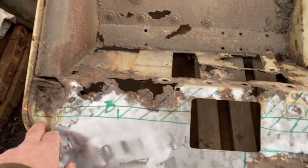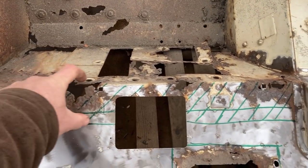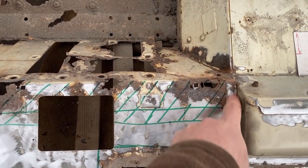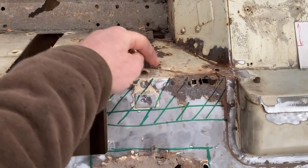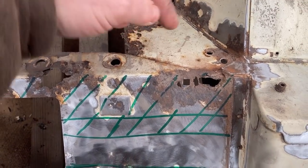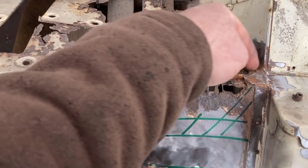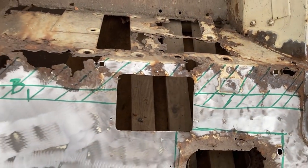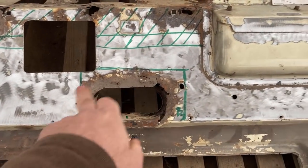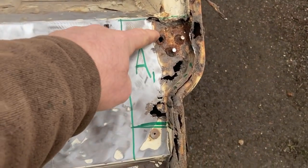So my first challenge is cut a patch out that I can put a fold down and basically just replace that all the way across. So it'll be butt welded along here. Lap welded into that. It seems to show a diagonal joint there. I'm not entirely sure how that's going to look on the footwells, so I just might take it straight across on the basis of it's easy enough to chop it out rather than add it on. So that'll be first patch. I'll bring you back to this one and this one, and then the second patch is over here.